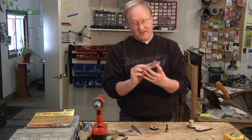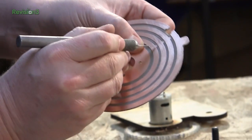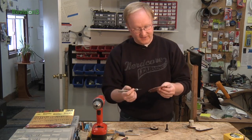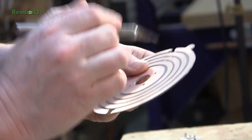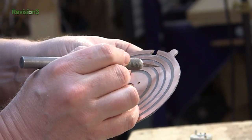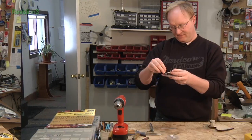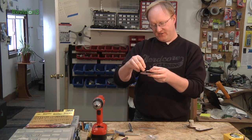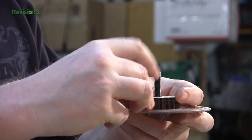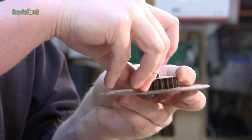Here is our milled PCB — there are three data lines per side. We made a little offset here so we can drill a hole through and get the via for the data to take it into the lights, but the brush won't hit it because the brush is smaller than that. The brush is about 3/16ths wide and we'll attach the wires right there. These brushes are spring-loaded and they'll press against it, captured so they can't move — so as this thing spins, they maintain contact.